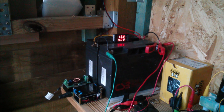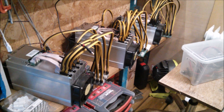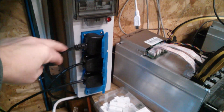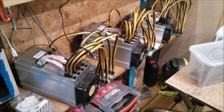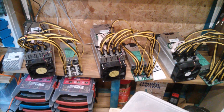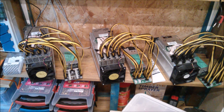I want to get those two additional charge controllers on so that it's a much more robust system and these batteries are kept fully topped up. Heating is done totally differently — it's done via mains. Here's my mains distribution unit — a little mini consumer unit, a caravan power distribution box — with three plugs going to three ant miners. They provide the heat but also earn cryptocurrency. The two miners on the left are far more efficient; they're scrypt algorithm miners. The one on the right is a SHA256 algorithm miner and it's not as good at earning money, but it does pump out the heat.